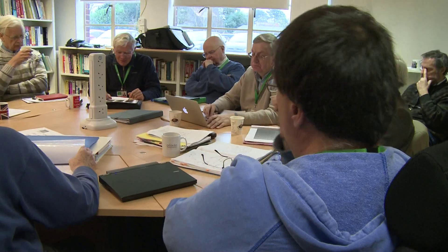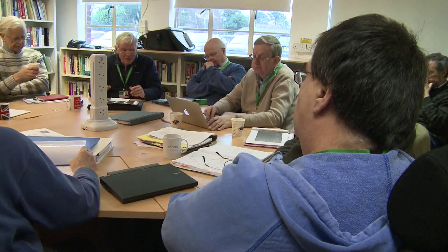What the clock monitor will be is both the chassis one pulse and the clock pulse superimposed in some way — they may be OR'd together so that you will see four edges. Quite often we find that signals aren't at the right voltage, or the shape of pulses aren't triggering things properly, and decisions have to be taken about how those problems are resolved — who has to improve their circuit, in other words.